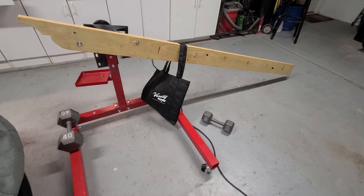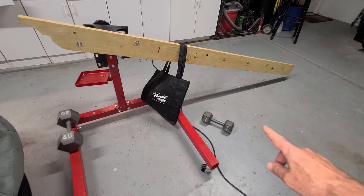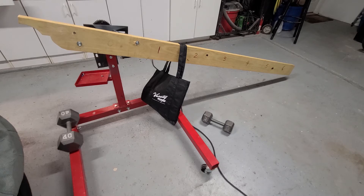Here's a good test case to prove the capabilities of the worm gear, its mechanical advantage, and that once in position it doesn't want to spin back — so you don't need a pin to keep it from spinning. I've set up a six-foot long two-by-six — a strong piece of wood that won't flex. There's a 40-pound dumbbell as a counterbalance, and I'm going to take a 20-pound dumbbell in a bag and move it at one-foot increments to demonstrate the strength and how it reacts. I'll put the math in the description.